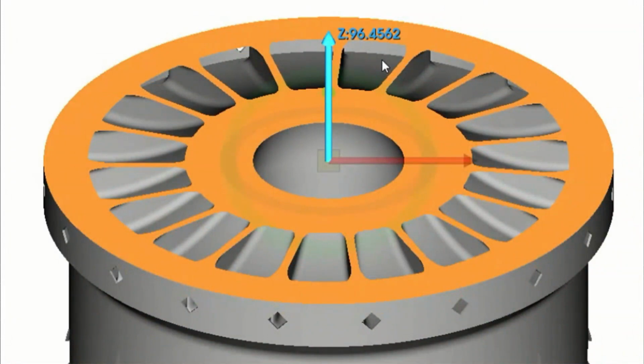And so you mentioned that top shroud. This is an example that we looked at before, obviously a different impeller. But walk us through what's happening here. This is a screenshot from Flow. We've pulled up the Z axis to a certain point in time in the build. So this is what the printer would be trying to do as it builds layer by layer. This would be an example of one of those layers.